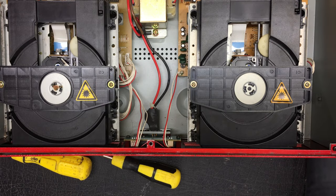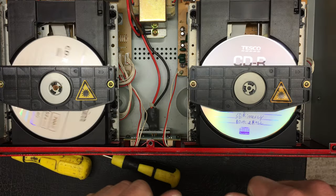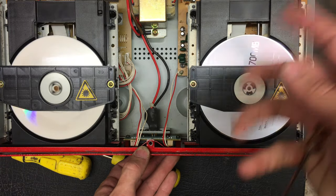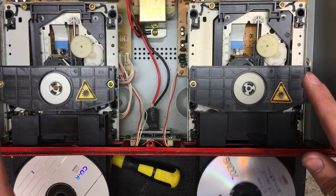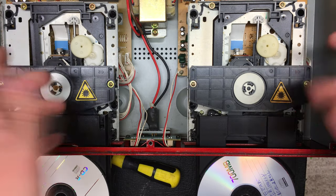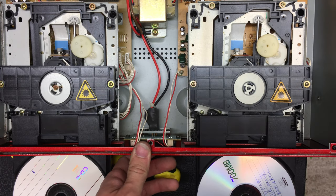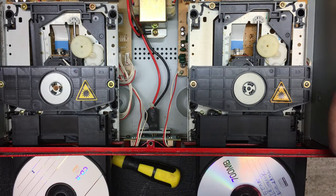Now we've got a unit where both trays open and close without any CDs in, and even with CDs in it still works. This one isn't reading discs - I'm going to do another video on that, on how to sort it if your laser won't read discs or if it takes a long time to read, so check out my channel for that. But there we go - that's how you fix the sticking trays on a CD player. It should work for CDG, DVD, anything with a mechanical drawer, even computer CD-ROM and DVD drives. If you like this video leave a like, put any questions in the comments, and subscribe for future random technology videos. Thanks for watching.